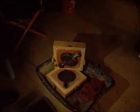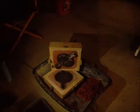Now we just take the camera off the stand. So we just cracked open our mold and we're inspecting it. It's pretty hot. I'm trying to keep the burnt sand away from the rest of the sand. What I started doing is putting all the burnt sand from the sprue aside, and there's a piece that's not burnt. It's hard to tell the difference, but especially as expensive as this sand is, well, I wouldn't say it's expensive, but about $1.20 a pound.